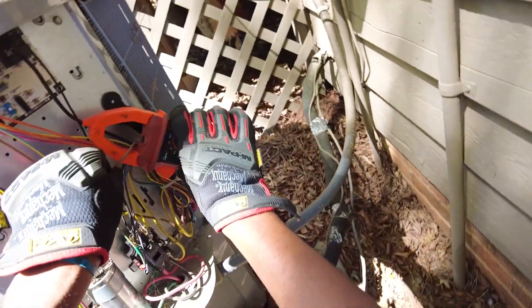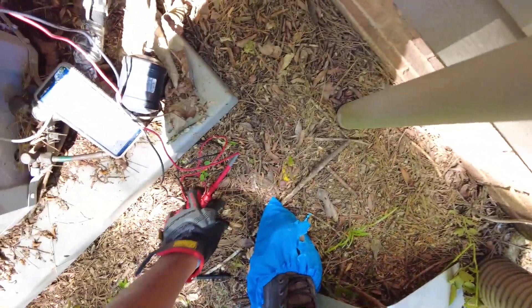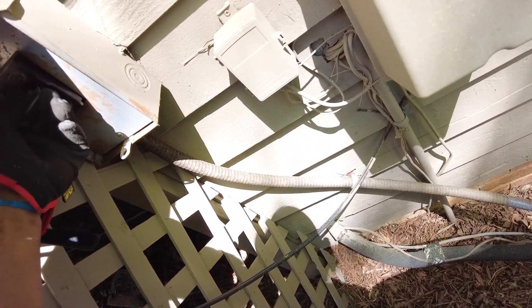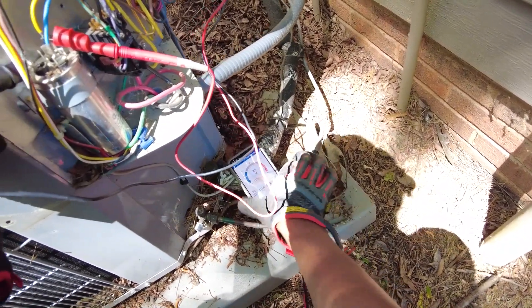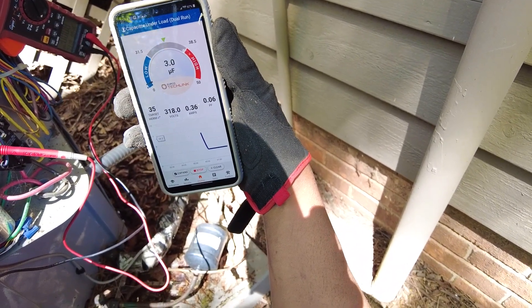So what I'm going to do is wrap it around the fan lead. Get that magnet stuck on it. One terminal and two common. Then I'm going to put the breaker in. I'll take the other lead here now and touch on the fan side. Oh nice — that is accurate. So we've got 2.9 microfarads.